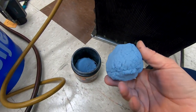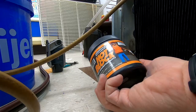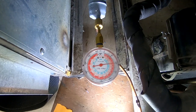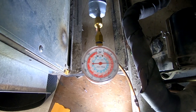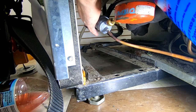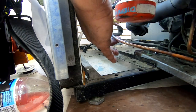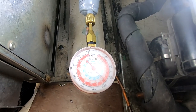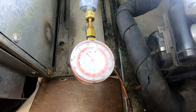So far that stuff's been pretty cool. We're gonna do a pressure test now to make sure everything's sealed — got our high side gauge hooked on there. Spraying for leaks now with Big Blue, using my fingers to spread it around the braze joint.